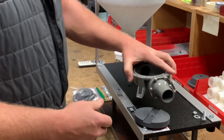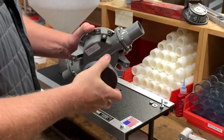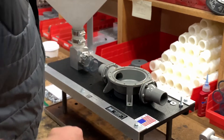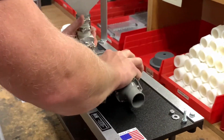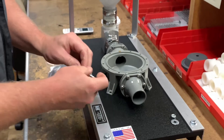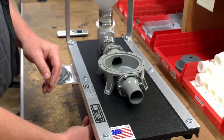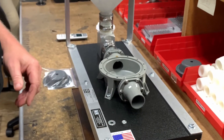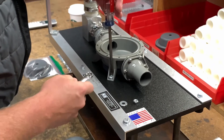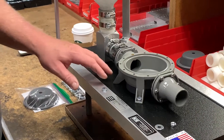When you go back to mount it, remember your puck — that's another thing guys forget and causes issues. Put the puck on, make sure it's flat, then slide this back into the hose and wiggle it to go back in. Then take your four one-inch cap screws, put those in the holes with washer and nut, and tighten them down. All you need is your 7/16 wrench and your screwdriver — putting your flat to the screwdriver will help bind it so you can tighten it up.